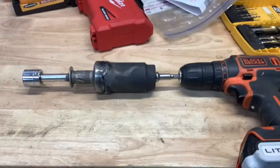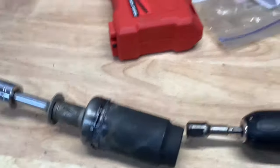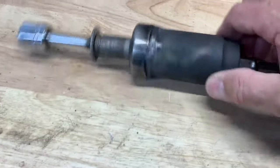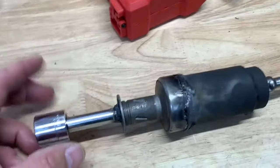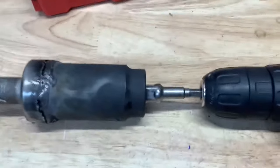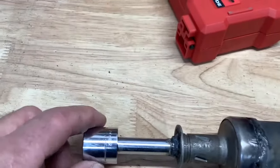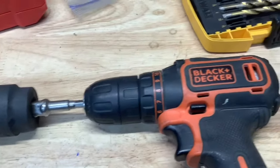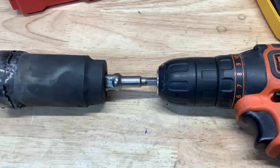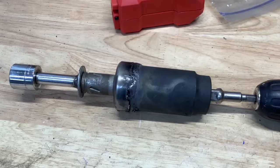Here is the finished project. I'm not going to go into detail using it — there are plenty of videos for that. I just hook my cordless drill up with a half-inch adapter and then I can put any size socket I need for the crankshaft on the generator. This spins around until the engine catches, then stops and freewheels while you remove it — protecting you against burning out the drill's clutch, ripping it out of your hands, or breaking your wrists.